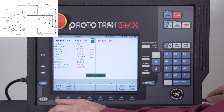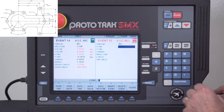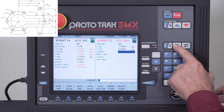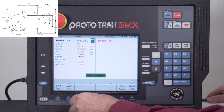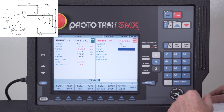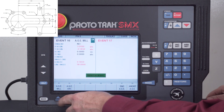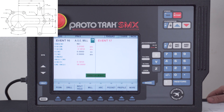I'll page forward and do another milling event — not tangent. X ends back at my original value of 3.910, Y uses increment set for no change. There's my okay, and I have a 0.4 corner radius. Page forward — looks good. The last piece connects back to the beginning at absolute zero, completing the pocket shape. Page forward one last time and push end AGE. That shows you how to use the pocket and the AGE to figure out dimensions that weren't on the print.